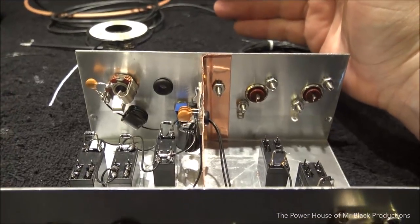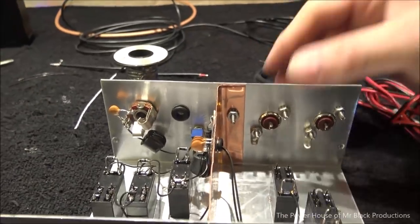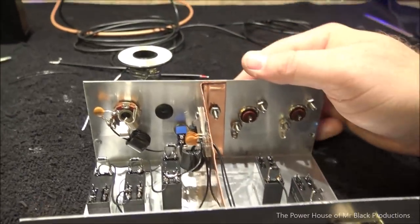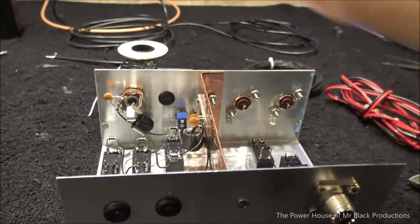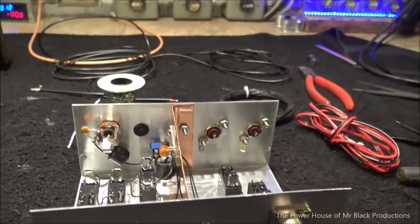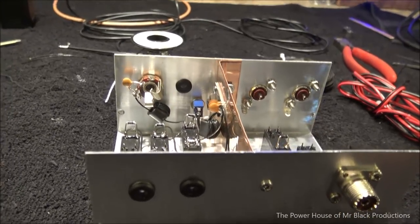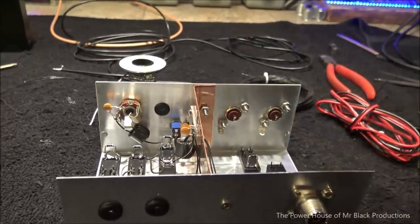I built my first one with a common ground and ended up having a ground loop issue between the power supply and the isolated radio receive. I ended up hearing Cruisin' with the Oldies is what I ended up hearing. Try it. I'm just saying this is the way I'm choosing to build this one. That way I know when I ship this thing 1,000 miles from here, the guy, when he goes and hooks it up, I'm not going to get this phone call. Man, I'm listening to Cruising with the Oldies over here. Because he picked up some AM broadcast station. Or, man, when I hook up to that box, I get a bunch of hiss and noise. I want to avoid that.